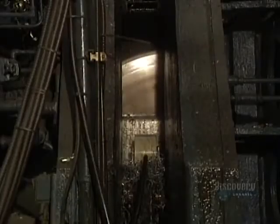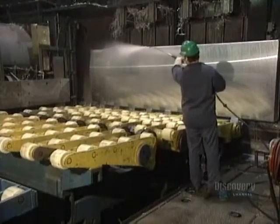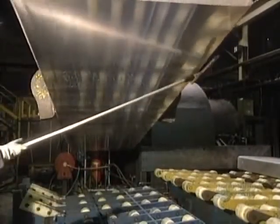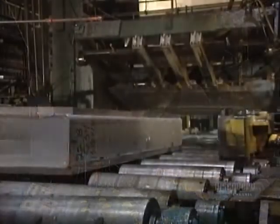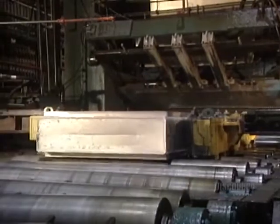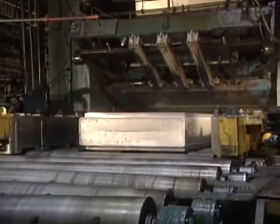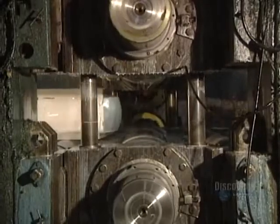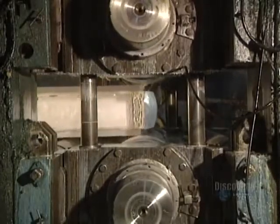This crust-removing machine removes 3 millimeters of the ingot's thickness. Impurities are eliminated to achieve a perfectly smooth finish. All traces of the liquid used to cool the decrusting knives have to be eliminated. The many steps in the thinning of the ingot begin. The aluminum block is crushed by the hot mill rollers.